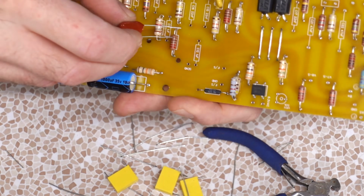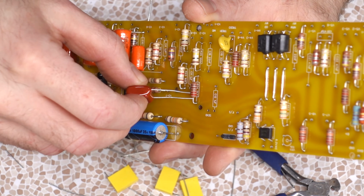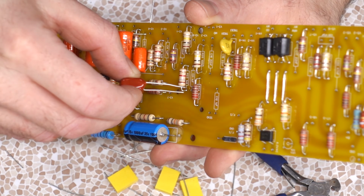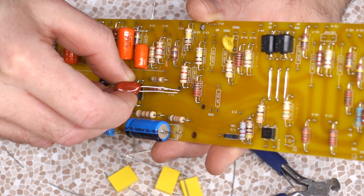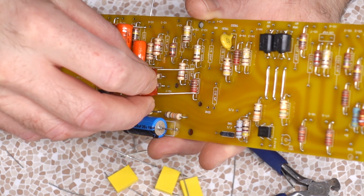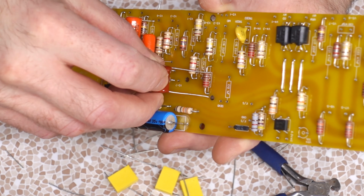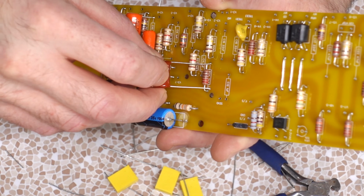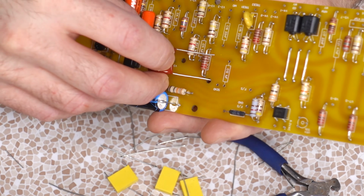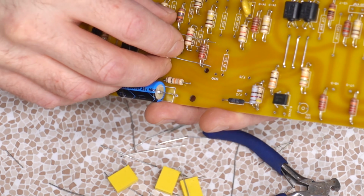I've also decided that since I have the 2.2K in here already, I'm gonna leave it. I am going to try to see what the effects loop is like on this amp stock before I change it to the mod. Because I did the mod to my Jet City, and I never really used an effects loop until I tried to plug in an EQ pedal one day, and it didn't sound very good. For whatever reason, I didn't like the sound of it. I also noticed that the sound of certain tubes that I like in the effects recovery buffer changed. I might have liked how that tube position was responding to tubes before the mod. So I don't know. We'll leave it like this for now. And because I have the mod on my Jet City, it'll be an opportunity to compare the two, because the Jet City is very similar to the Soldano tone-wise.